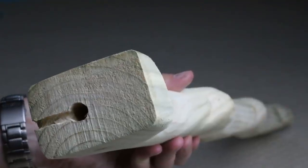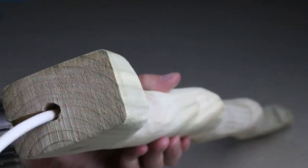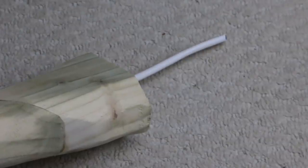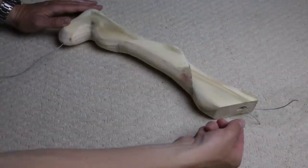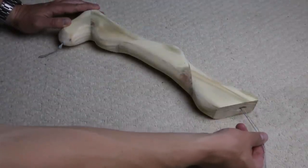With that out of the way, I can get some work done in terms of electrics. I'm first running a mains cable through the lower two sections, and I chose this type of wire because I'm gonna power my light from the mains voltage. Having said that, I've already got a lot thinner wire in my top section, but it's fine, because I intend to power low current LED strips. If it wasn't the case, I would run a risk of burning that wire.